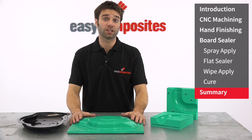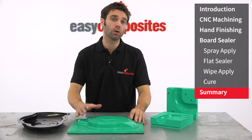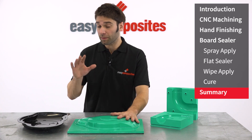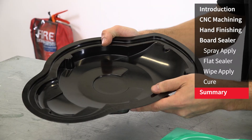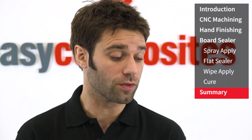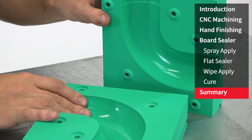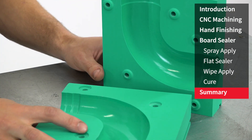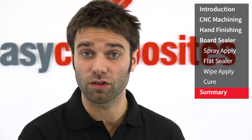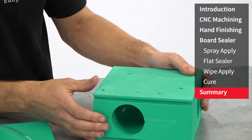This pattern is now finished and ready to take a mould from. Epoxy tooling board is compatible with virtually all composite tooling methods, but in the next video we'll be using it to produce a pre-preg carbon fibre mould. Alternatively for prototype parts or short production runs, remember it's totally possible to machine moulds directly from the tooling board - here is a mould that's been machined to produce a 90 degree tube section and this could have the pre-preg carbon fibre laid straight into it.